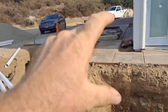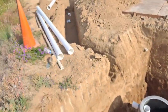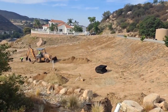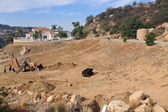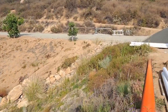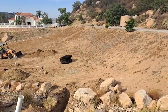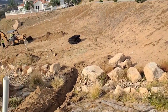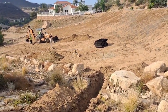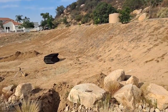That riser is going to get put on here so the cap is flush. So if it ever needs to be serviced, you don't have to dig anything up or do anything weird — this is a way better way to do it. Back over here at our first septic, it was covered by like a foot or so, maybe a little more of dirt. And in the middle of summer when we had just moved in, it was rock hard — I had to chip away at it with a big bar and a pick, trying not to slam it so hard that I'd break the concrete lid. It was a nightmare, and that's why I converted that one to the flush tops as well.